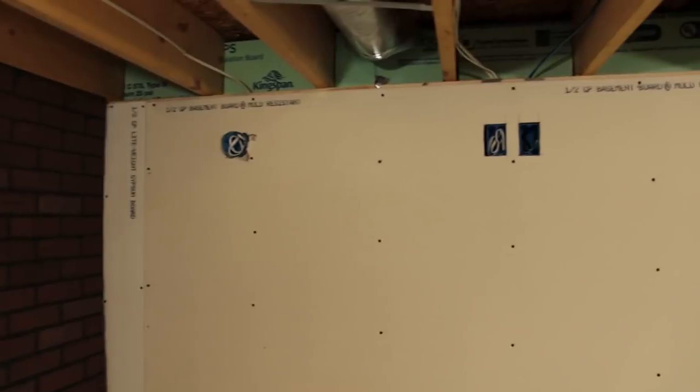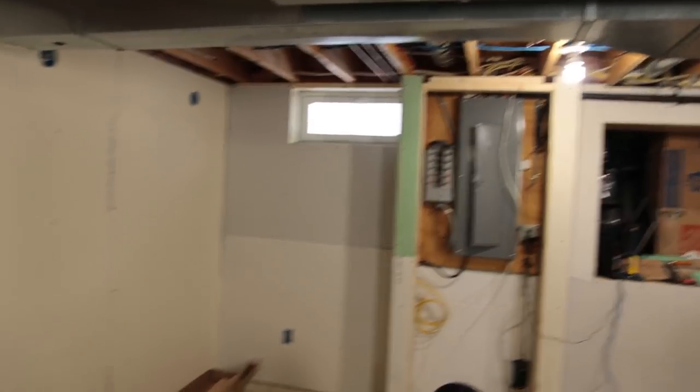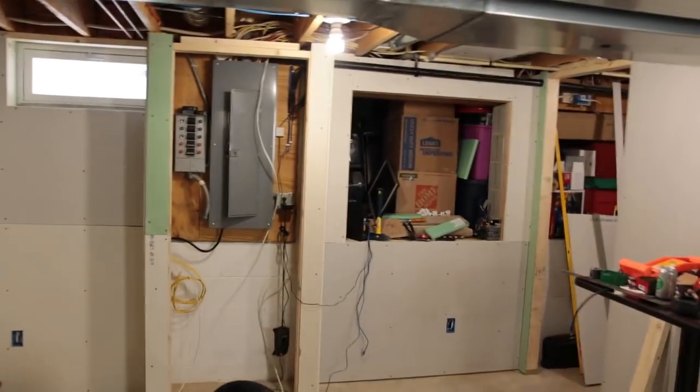Now onto the lack of drywall mud. Everywhere there is a seam, I'm going to put a column — a three-quarter inch piece of oak. And then all the way along this line, and same thing here: there's going to be another column here, another column here. My corners will be finished, but there's going to be a three-and-a-half inch piece of oak running around that entire 42-inch height. Probably a little piece running over into the brewery area. And on that, I'm actually going to put a shelf — a glass rail all the way around for you to set a glass on, because we have an arcade machine over here. I'm making it the same height as the bar. So that's pretty much all of the drywall done.